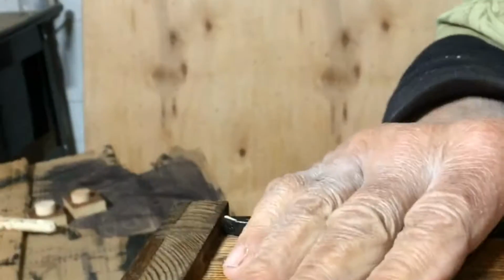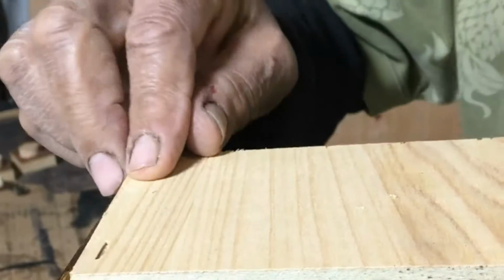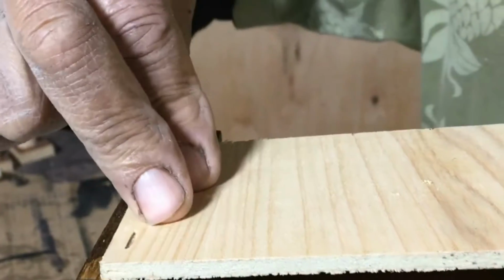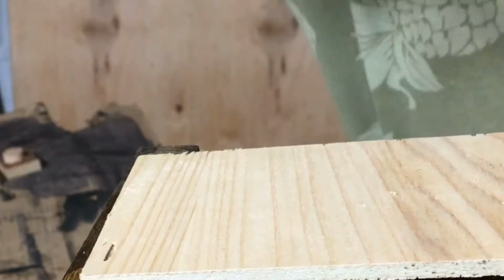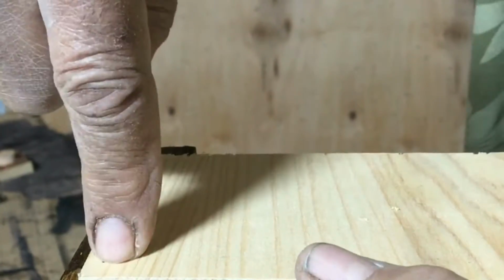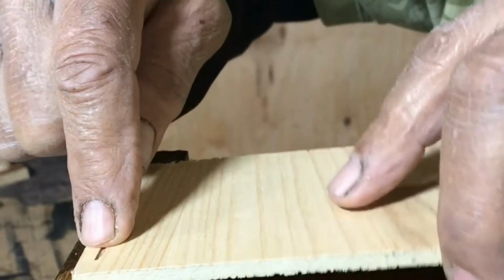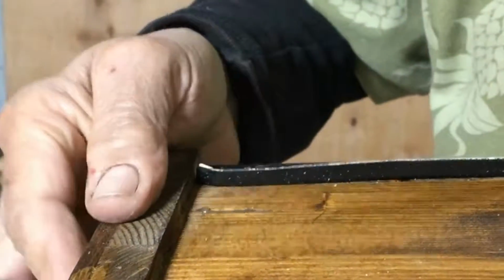So he should have had this on the side of the drawer, or cut into the face of the drawer where you wouldn't see the side of the drawer, but you would have this cut down into the face of the drawer, or rabbeted, say. Then you'd have the strength, because now this would be going into here, and the shear action of the nail or the wood or the glue is going to be stronger than the tensile strength this way. And that's what they should have done in this drawer. So eventually this is going to pull apart.